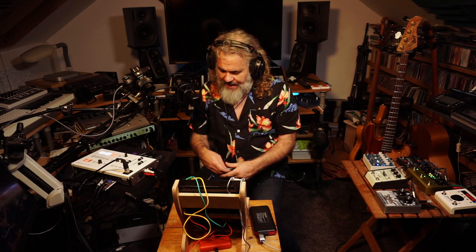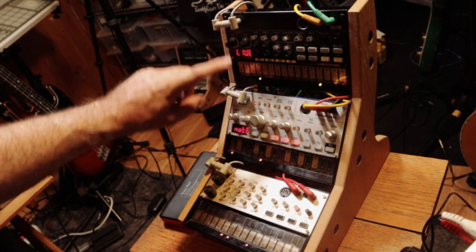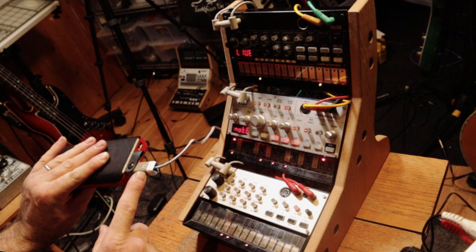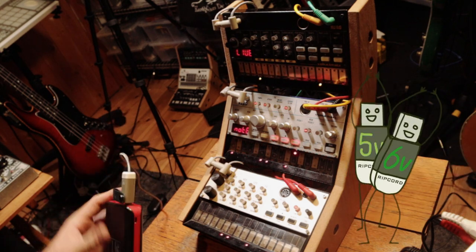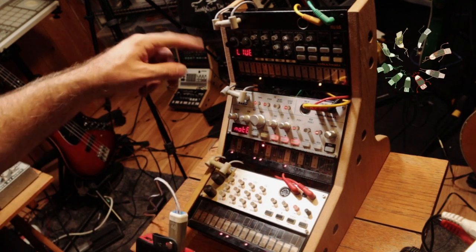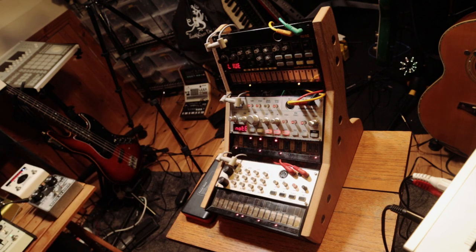But first, in front of me is a little Volcas rig, and I'm using some of the Crazy Chain cables to power it. The power is actually coming from this USB brick and with a Myvolts Ripcord. Those have been out for a few years now, and they're clever. They basically step up USB to 9 volts so we can power our Volcas. But now we're making a chain, so the single chain is linking on multiple ones so we can power the 3.